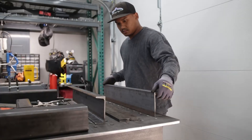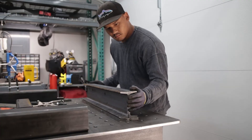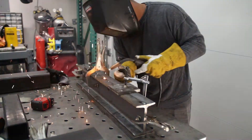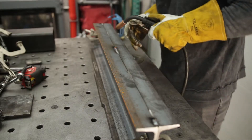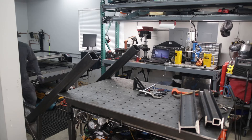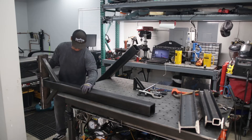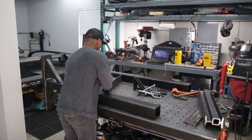To make the bed frame and the upper crossmember, I decided to use C-channel because it was easier to source. I-beam would have worked as well, but at my local yard I'd have to special order it or get a remnant drop. I used a half-inch flat bar and combined two C-channels to make my desired I-beam. After getting my two uprights tacked in, I jigged them up on my homemade fixture table to get them positioned and squared. I can't say enough good things about this fixture table — it really has made fabrication more enjoyable and helps keep my parts in position.